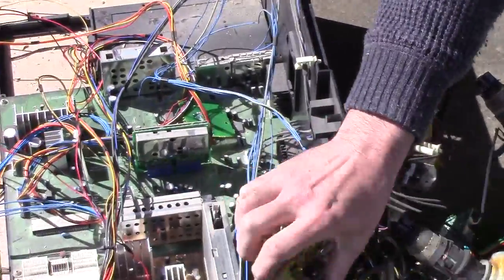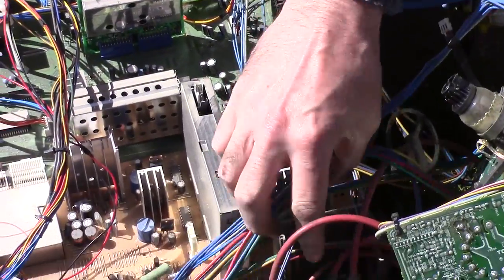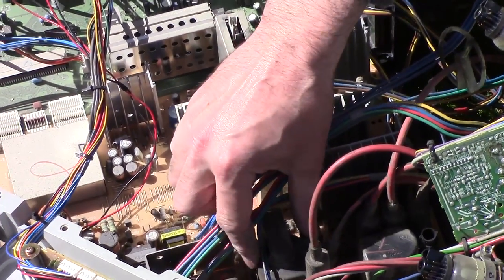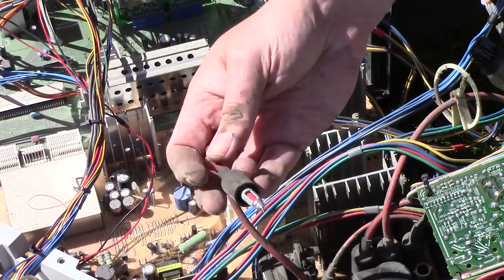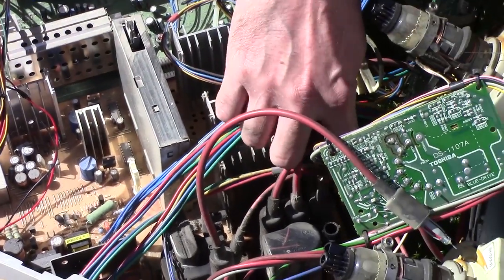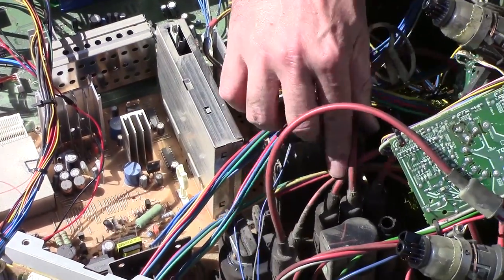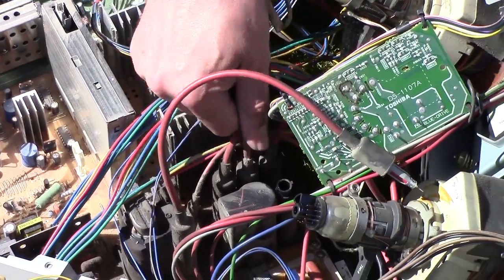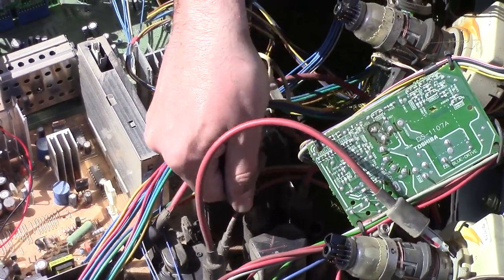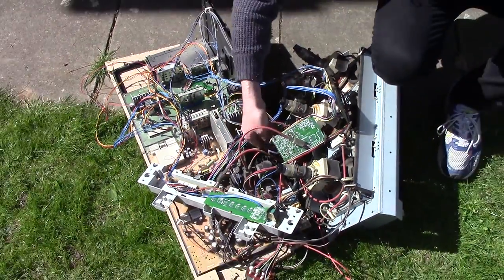It's one of our high voltage cables. Now, interestingly, they've got an arrangement here because they've got three guns and they need a higher drive voltage on this. They've got a standard TV flyback transformer here which will be knocking out 15 to 25 kilovolts on there, and they're feeding that into a secondary transformer that'll be upping the voltage again for the three feeds that actually lead off to the three different CRT guns. So should just unplug. There we go. Difficult doing it one-handed.